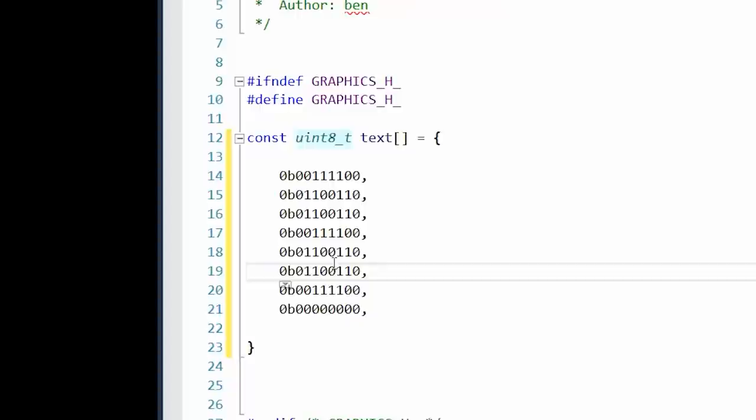Anyway, how the Apple II did graphics is it basically tricks the NTSC color burst phase into displaying what you could call pseudo colors. It would do that by having bit patterns like that versus that, and then they also had a control bit. I think it was one byte, but one of the bits was a palette or control bit. So the first one wouldn't actually appear on the screen. The actual data on the screen would be 1, 2, 3, 4, 5, 6, 7, which means the screen memory was divided by 7 horizontally. That's why if you play an Apple II game on a monochrome monitor, all of them will look like vertical lines, and those lines were used to trick color into being.